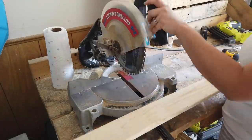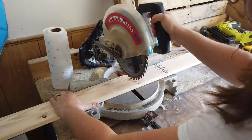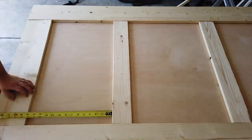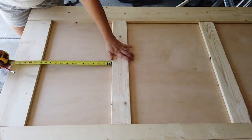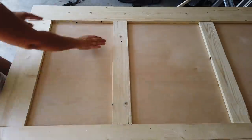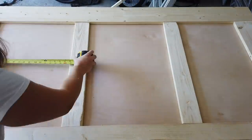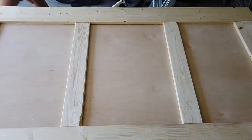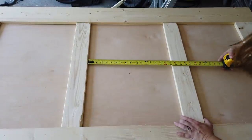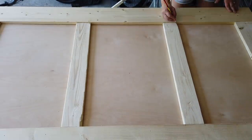Now for the pattern in the middle, I'm not going to do the traditional X pattern — I have one of those barn doors in my dining room and that just doesn't fit with my bedroom, which is more modern farmhouse. So I'm going to do a paneled door. I took that 1x4x8 foot board and cut 3 pieces to the same length as the top and bottom 1x6 pieces, then spaced them out in the middle of my plywood to make panels. I used wood glue and my nail gun, and I marked the spaces with a pencil after measuring so I knew where to place them back after flipping to apply the glue.